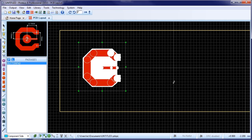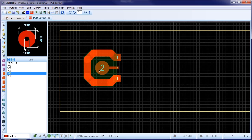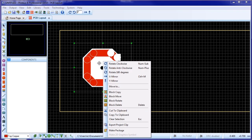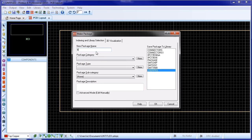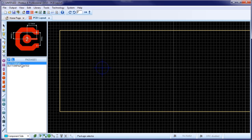It's often recommended that these land patterns allow for venting via a drilled centre. We could add this easily by dropping a via over the centre pad and then remaking the device. Depending on the manufacturer's spec, and provided a connection can be made from the other side of the board, this would actually greatly simplify the rest of the land pattern. Once we are finished, we can then delete our graphics and place the packages directly on the board.